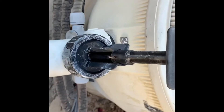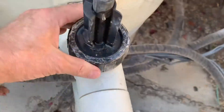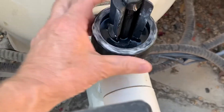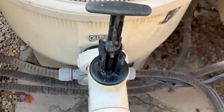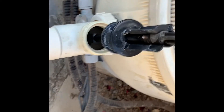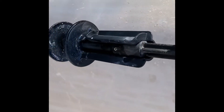Then we're going to pull straight up on the valve toward you — there you go. The water should be draining out the backwash valve now. You likely have a hose attached and it will drain in an area away from the filter so you're not standing in water. Release the locking collar counterclockwise — takes a few spins. Then grab it and move it straight up. The piston is a little tricky; you've got to get it around the handle — just tilt it sideways and it comes right off. The piston itself may have been locked in there for years, so keep at it with firm pressure, wiggling and pulling straight up perpendicularly.